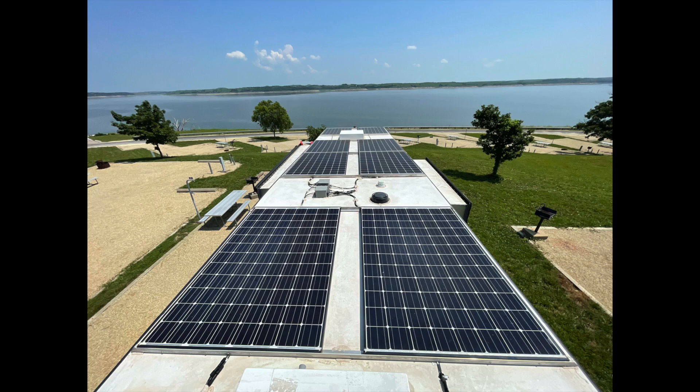We're going to start by showing you the old solar system: 3,350 watts, ten 335-watt panels. You can see there are some gaps in the coverage as a result of the mini-split cassettes, and there are gaps down the middle. So we swapped that out to a new system.